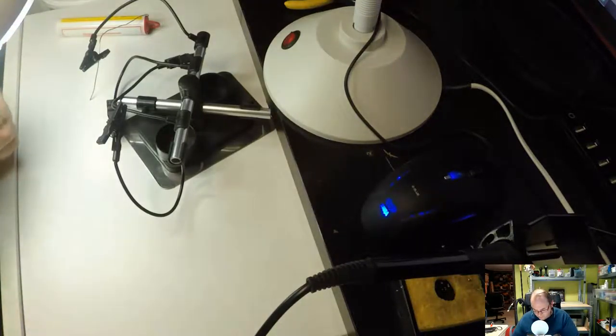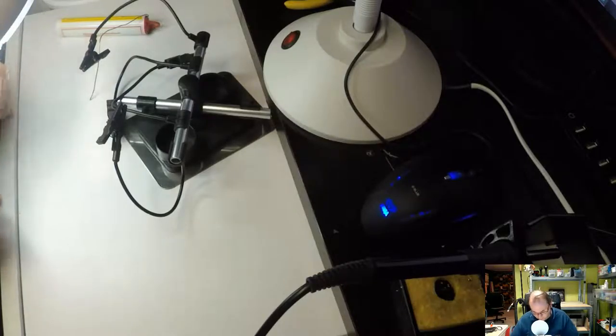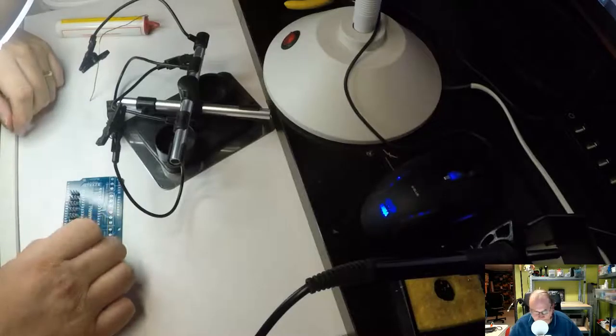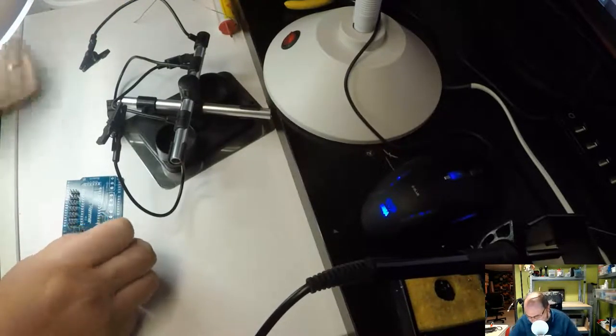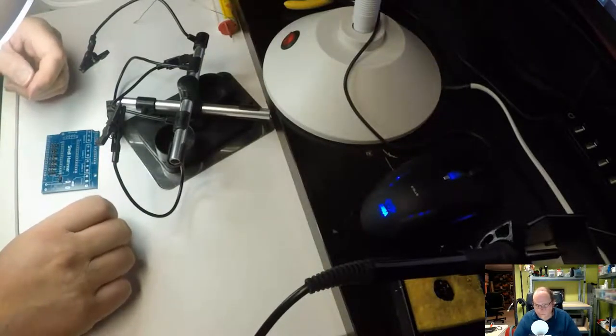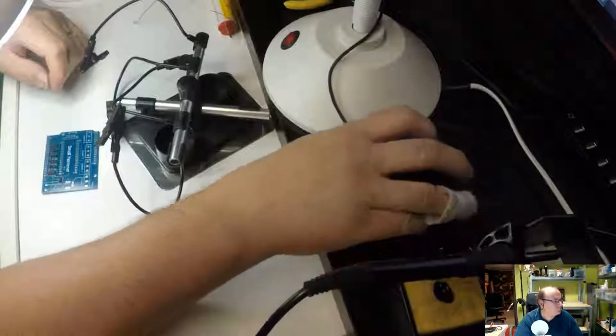That means that if you solder it only on one side by accident, the electrical connection will still be valid for the other side. But this is not a high current application, so the soldering can be pretty crappy before it totally fails.